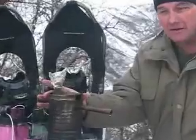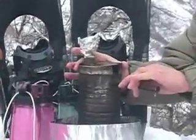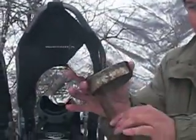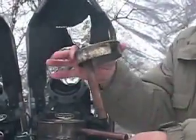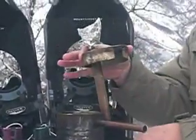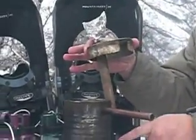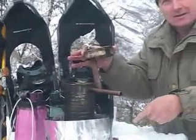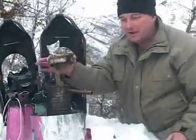This thing is just made out of a metal can. What we've done is soldered some copper tubing here. That tubing goes all the way to the bottom of the can. When you pour water in, it has to go to the bottom where the flame is. The hot water rises to the top, comes out of this tube and into your glass. That way you have a continuous supply of hot water.